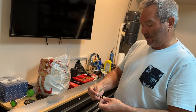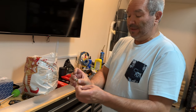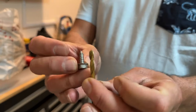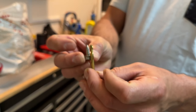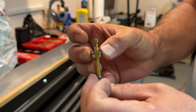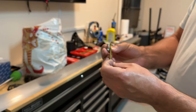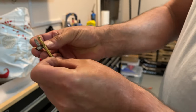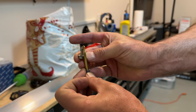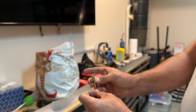I'm picking the drill bit so that it is not too big — slightly less than the threads. It has to be the same diameter as the solid part of the screw, so that it actually catches with its threads to the aluminum as well, so that it sits tight. Now, if you look through, you can see the diameter of the drill bit. Behind it, the threads are sticking out — that's how you want it.